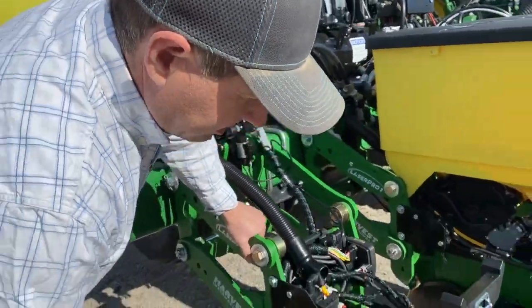On the fertilizer system, we have two different fertilizer systems on this planter. One is going to go out through the wings — the furrow jet has three different points where we're going to be sending fertilizer out. Another system is going to be going out the center and doing infurrow. We have an electromagnetic sensor that's sensing the fertilizer content, so there's no turbine anymore in the sensor — nothing to get plugged or jammed. We'll be reading row by row how much is being applied through that sensor on the wings.